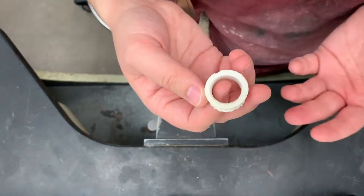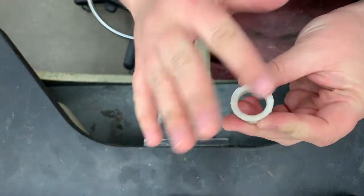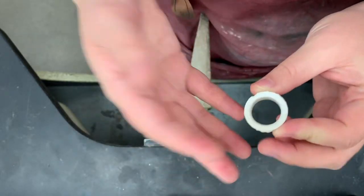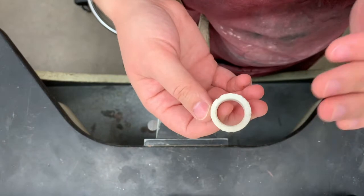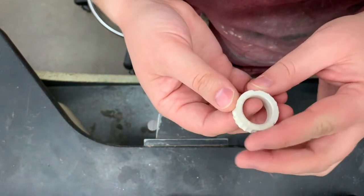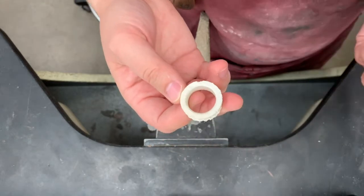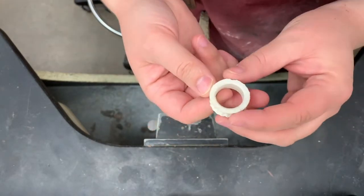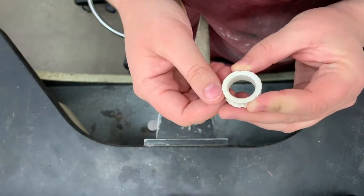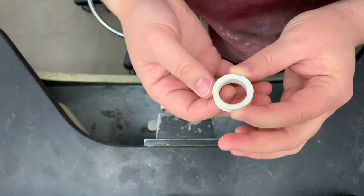It's just something that happens, so if you run into it, you can try to file and sand out that pit, and sometimes it comes out. Sometimes though, a deeper pit will be revealed. So it's really up to you how you want to handle those pits. If you have access to soldering equipment — I know some of you have studio setups at home — something you can do when you get pits is you can just fill it with solder and then sand any excess solder away.